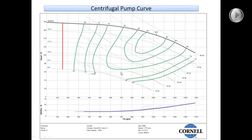So is 85 percent efficiency on this pump the best you're going to get? Yes it is. And is that pretty typical? For new pumps, your best efficiency point is usually around 84 to 86 percent.